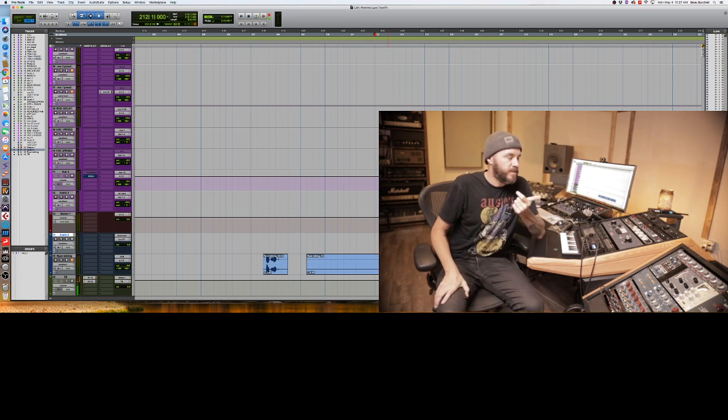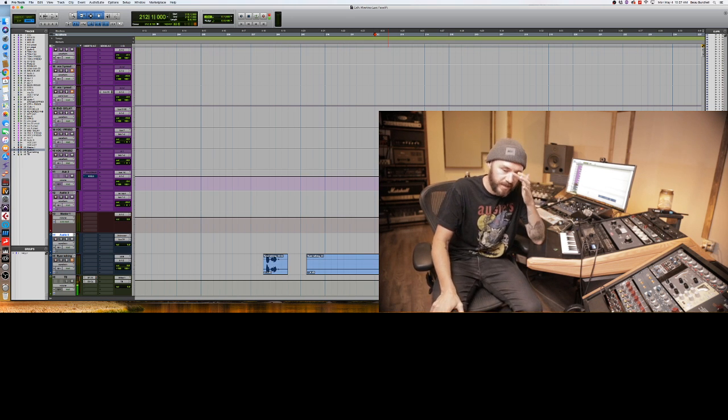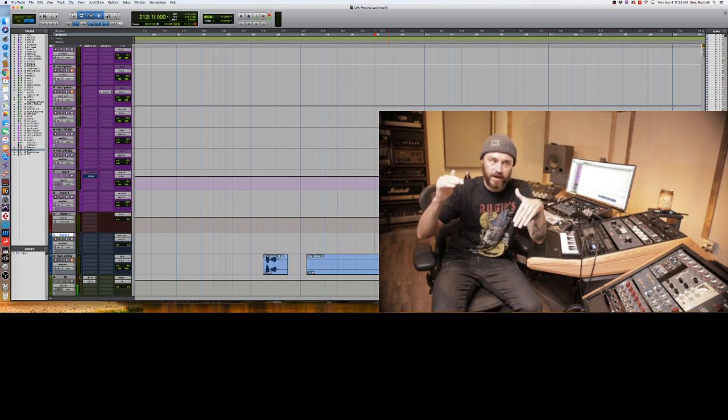All right. So with all monitors that have the DSP built in, there's latency because it has to do an A to D and then a D to A conversion. With the MM45s, I wanna say it was somewhere around 3.5 milliseconds. And I run a stereo set of subs in here. So for me, having my subs aligned with my mains should be very important.